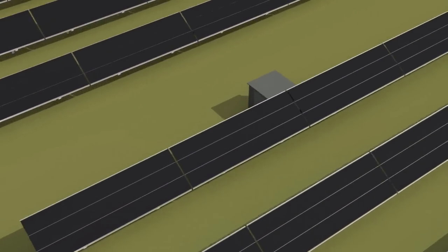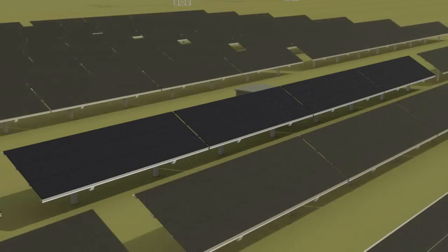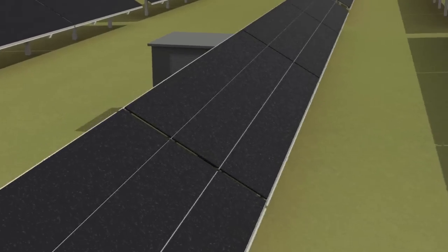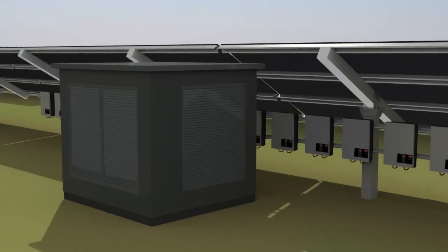Four substructures are connected to each inverter. The top, middle and bottom rows are wired in three strings that are each connected directly to their own maximum power point tracker. The transformer station is located centrally in the quadratic PV field. The cable length between modules, inverter and transformer is consequently minimized, ensuring minimization of cable loss on the DC side and on the AC low voltage side.